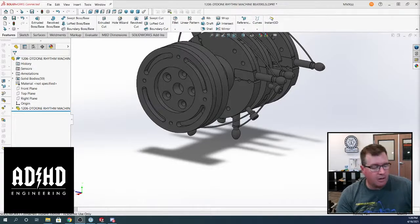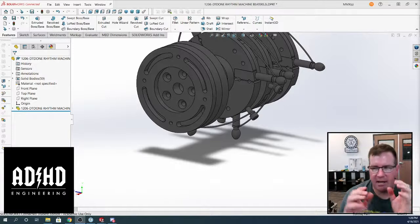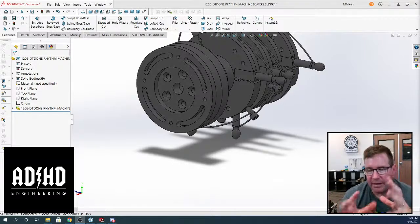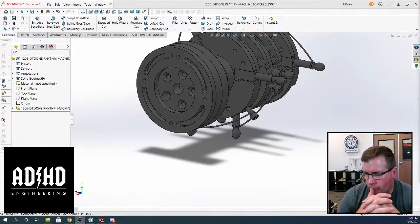Right. So that's what we were saying. If we made a good starting skeleton where we just had the major control points, like the locations of the transverse shafts, the drum. Exactly, just the points of the critical stuff. And all that was parametric, and we had variables that called it out. Then we could make a machine where we could adjust those things easily, and it wouldn't totally break the model, right? Well, it's an idea, but when you're talking about 10,000 parts, it's gonna break somehow.